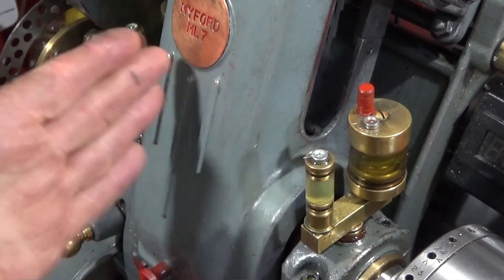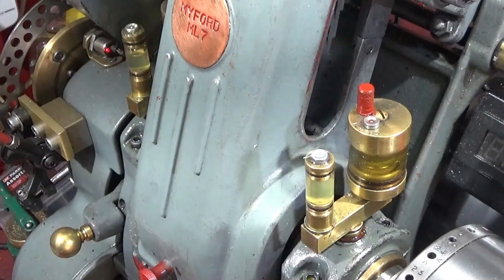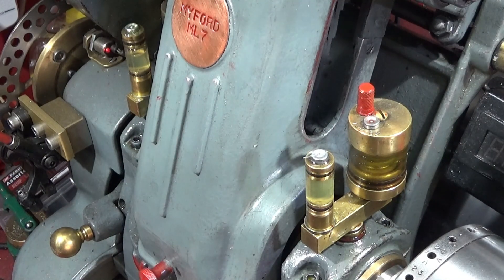I made these front and back for both bearings and this has saved me so much oil. I did have one of the bought drip-feed type oilers but I could never get the control right and they used to waste a lot of oil. This is the best method for saving oil but also for protecting the main bearings.